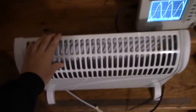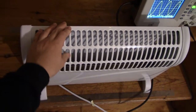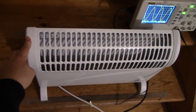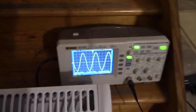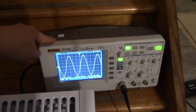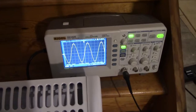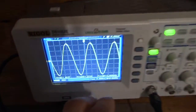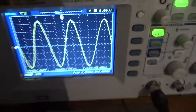Here's the test setup. This is a 650W and 850W, or 1500W combined, electric heater. The oscilloscope is connected straight to the mains, measuring between earth and live on the inverter output. As you can see we've got a perfect 231V at the output.